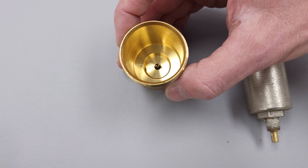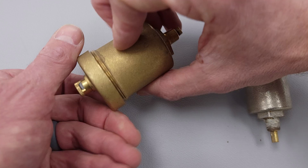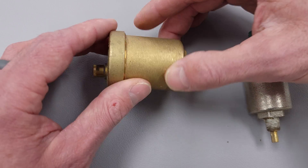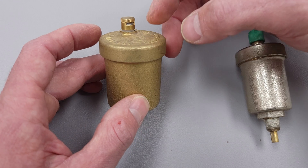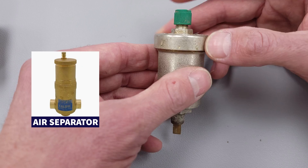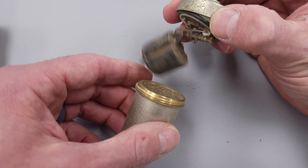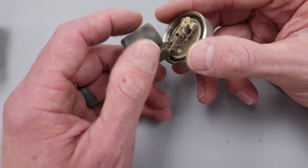Make sure the walls are all clean and that it is completely vertical. Basically, water is always going to carry a little air — even when you fill a boiler it will have micro bubbles. You may need something better than just an air scoop and an automatic air vent or a high point vent; you may need an actual air separator. That's what we're typically putting on newer boilers — it has a coalescing material in a low velocity area and is actually able to get the micro bubbles out of the system.